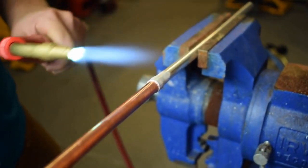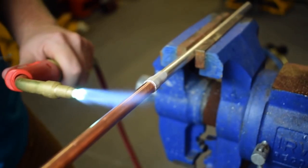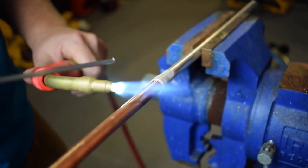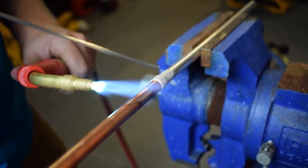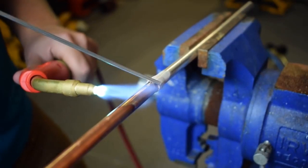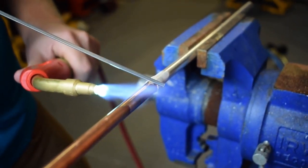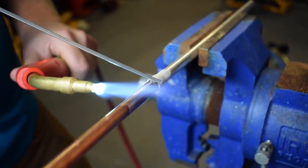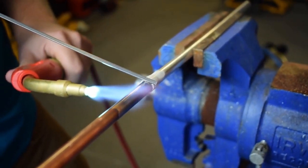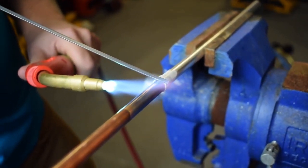You want to apply heat back on the copper because it's in the safe zone, so here we're definitely not going to cause too much trouble with the aluminum. What we can do is then just kind of brush forward just a little bit and apply the rod to the top of it here, so that once it hits the temperature the flux will start to run. And once that happens then it will wet the copper and the aluminum.